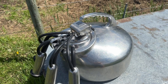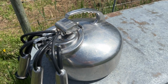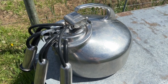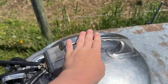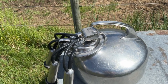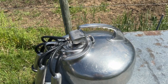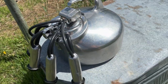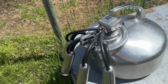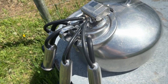Sometimes I do have symptoms of carpal tunnel and my husband's not always home, so when I'm able to I use the machine on Penelope. The whole idea of the surge bucket milker is it has a handle portion with a bar and a strap that goes over the back of the cow, and the milker sits on this bar underneath the cow's belly — that's why it's called a belly milker. That way if she moves around the bucket always stays with her and the inflations and hoses are never stretched to the point where they fall off the teats.